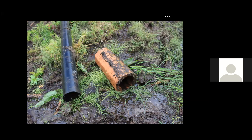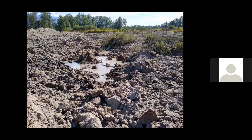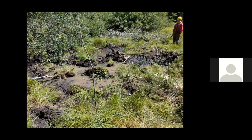Here we were building a groundwater dam and you can see the pipes unearthed in digging the trench. When we build a wetland, we generally make it deepest in the center, with gradual slopes, pits and mounds, and we place trees and shrubs in them so when they fill, they provide habitat for many animals. Here's a groundwater-supplied wetland filling as we are building it — most groundwater wetlands fill within a couple of days of construction.